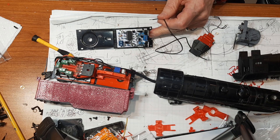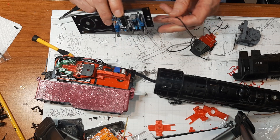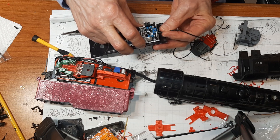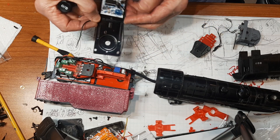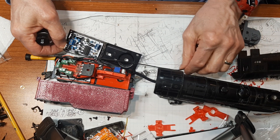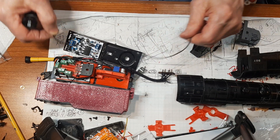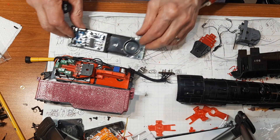To connect to the motor — in this case we mounted it in the front and the motor's down there; you can flip it if you want. For the motor, you raise the locking screw up — that's like unlocking it — then push your motor wire in there and lock it down. You're going to run this wire out in front. If you have a connector you can just plug it in like that, or you can wire it directly to the motor. Line them up, trim them, make sure they're routed, secured, and the right length.